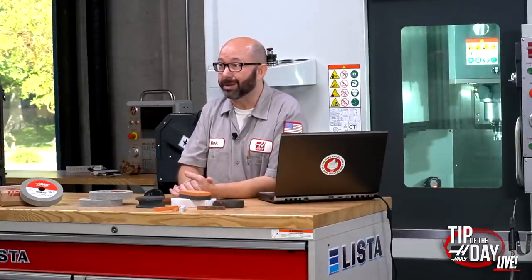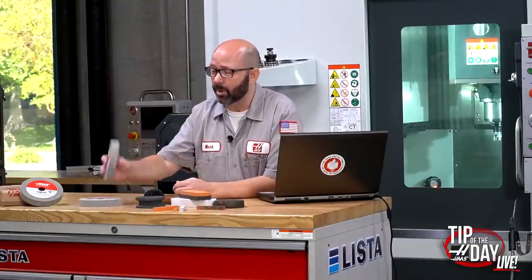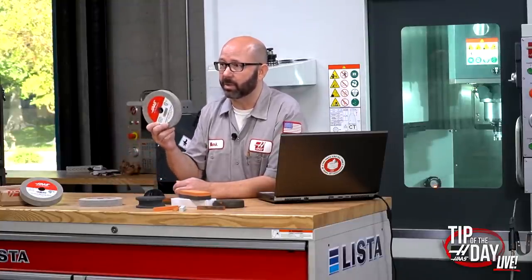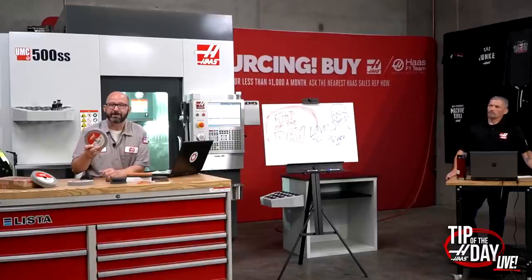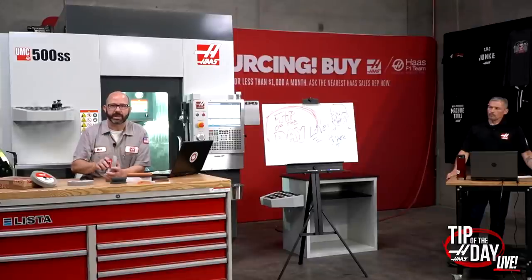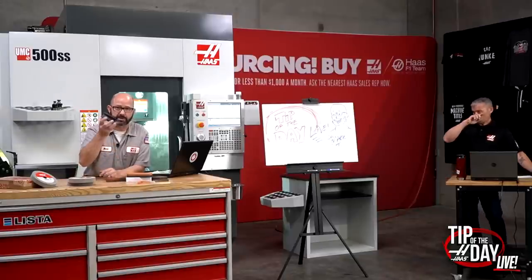Silicon carbide is brittle sharp, so it's really good for cutting lots of different types of materials. A lot of people go with a silicon carbide deburr wheel for everything because it works on just about every material. It's fine on aluminum — nothing's great on aluminum, but it's pretty good if you're light with it. It also handles bronze and hard stuff like nickel alloys, titaniums, and tool steels. But don't push too hard — it'll break down because it's brittle.